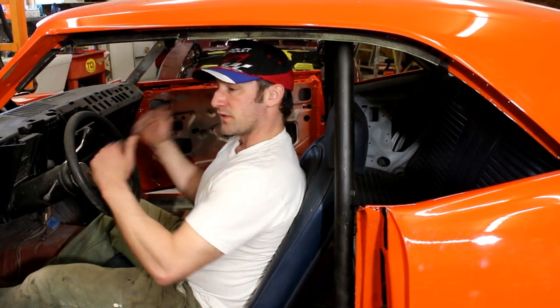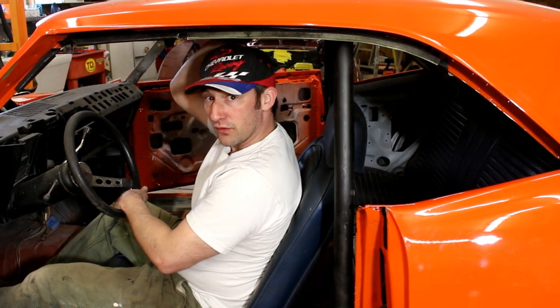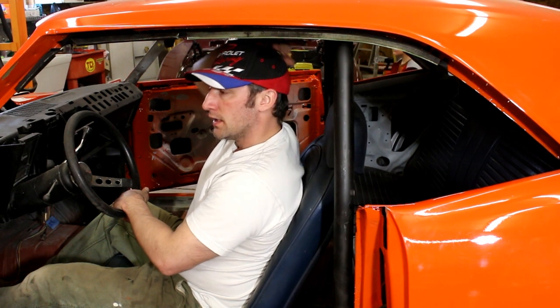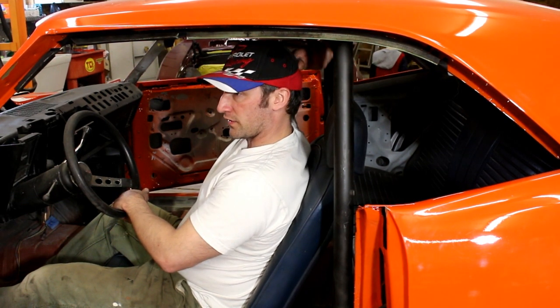Now I don't want that. I want at least a half inch clearance from that headliner. It's just gonna rub. The directions actually even say to make sure you have a little clearance. But NHRA guidelines are gonna also determine whether this hoop can go. NHRA for this classification of racing, I've just read it. I don't memorize this stuff. But it's no more than 3 inches above the top of your helmet, and no lower. I think you can go higher, no lower. And then check that. But the back of the helmet as well, no further than 6 inches away.